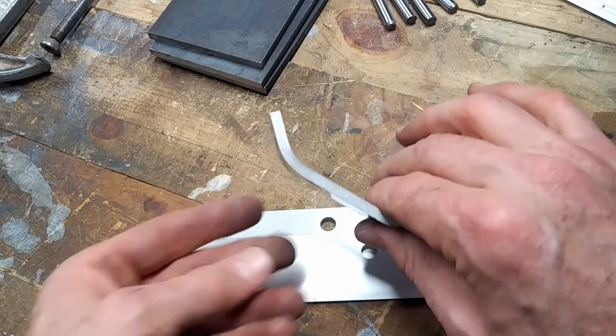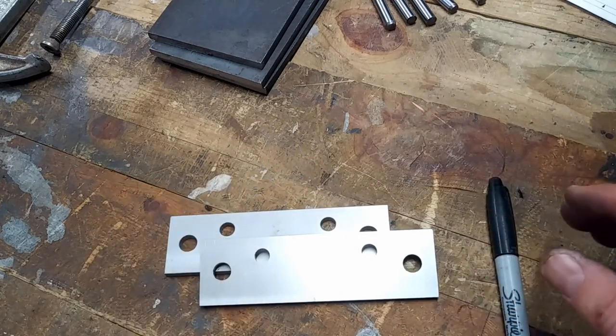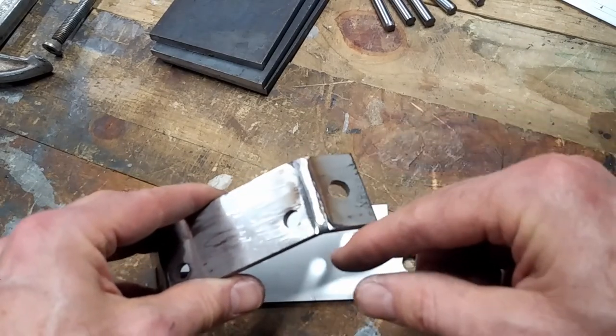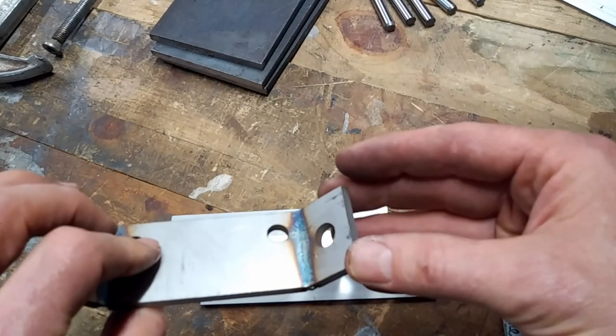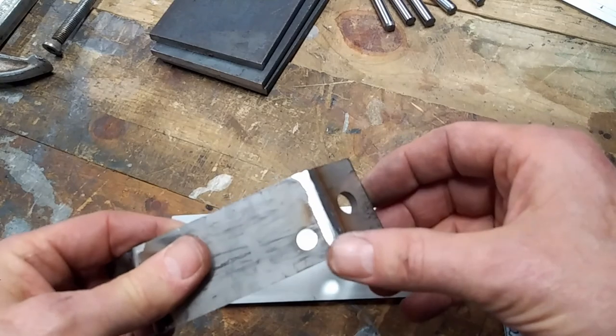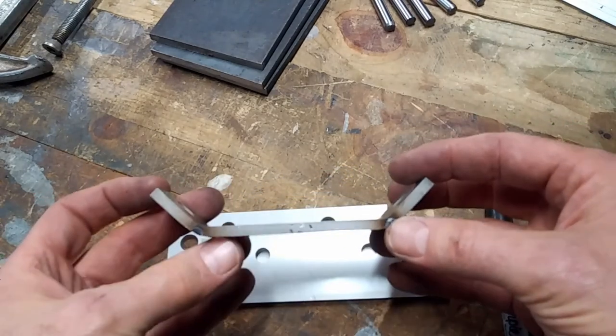That's obviously not the right approach. Don't worry about that center one. That's something I played with a little bit later, but was unsuccessful generally. So I tried the technique of cutting, where you slice along the outside and then you weld fill. And that works pretty well. It gave me kind of what I wanted, but it just seemed like a lot of extra work to get the bends that I needed.